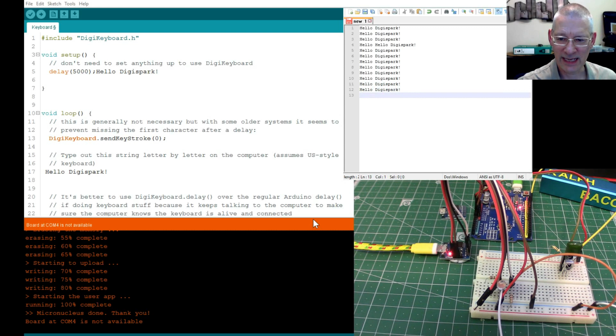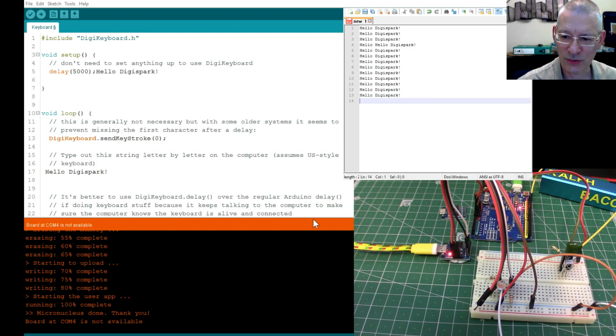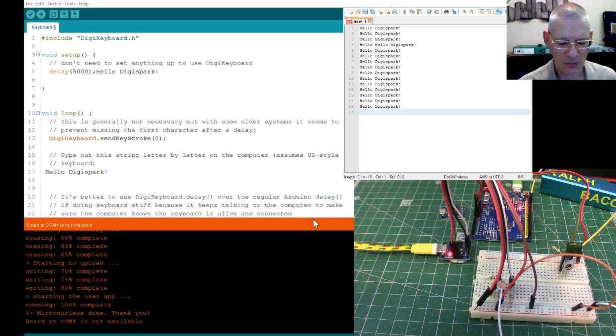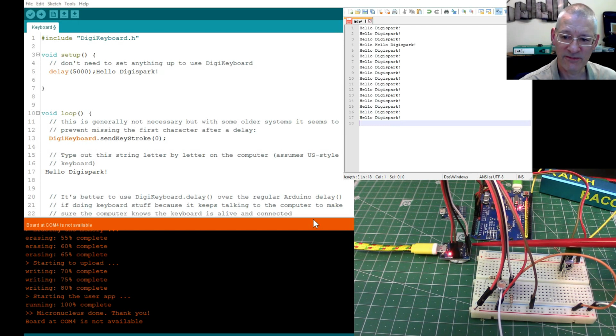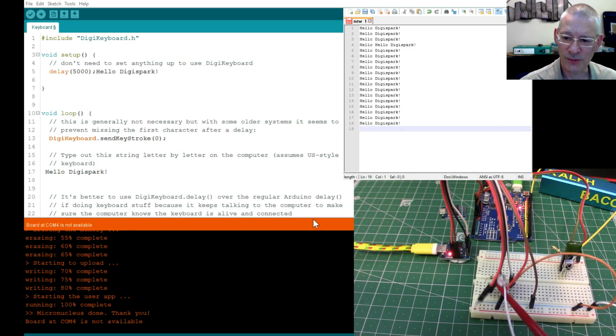Okay, so that's that. We might do another video on this sometime in the future when I've discovered a few more things about it, but I was just bringing this to your attention, that it's a nice cheap little board, can do some things, but it is restricted in some ways because effectively you've sort of got 3 pins, haven't you? If, however, you don't want to program it via the USB port or are prepared to disconnect the pins down here whilst you program it, then you've got another 2. So that means 5. But I do want to put that pin extender on here sometime in the future.